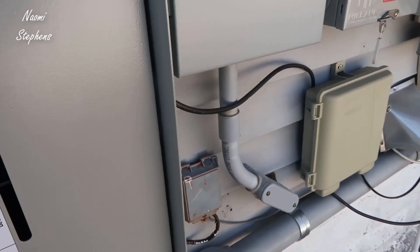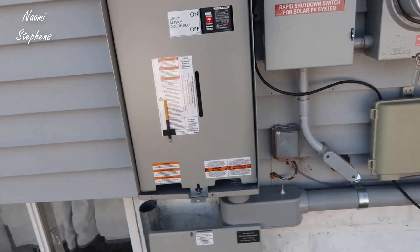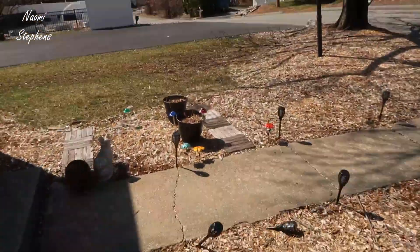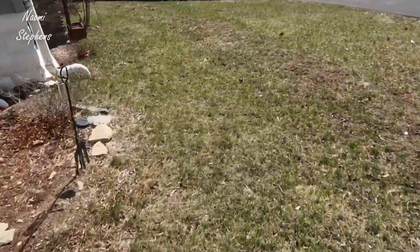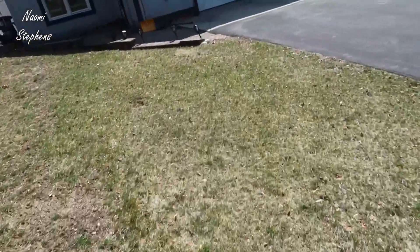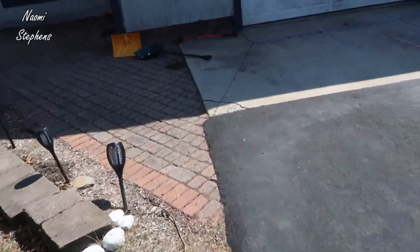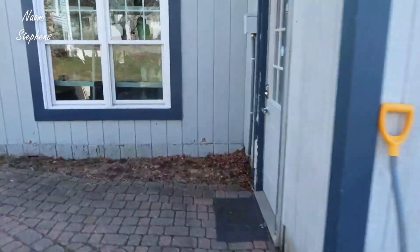What we're now able to do is — during a power outage, once we see the whole area has lost power — I go over and switch this off, then head to my 50 amp connection. I'll run around the side of the house and show you where I have that all connected. We had one outage where I was able to test this and it worked out pretty well. We have a large property — actually two 200 amp breakers, one here and another in our garage.